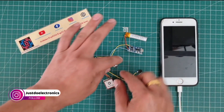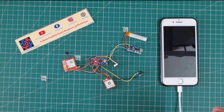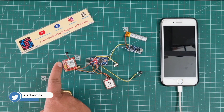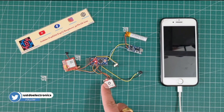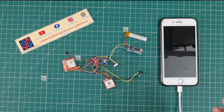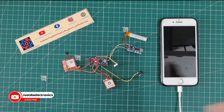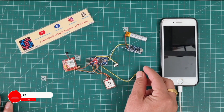I just turn on the system. I am right now in my lab — this is an indoor test. The GSM finds the signal and this LED is stable. However, the GPS blue light is not stable, meaning GPS is not working properly indoors. If I go outside to open space, the GPS will work properly.